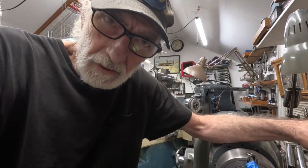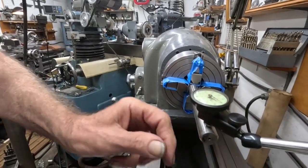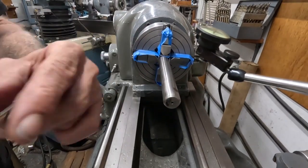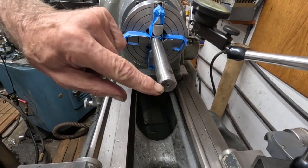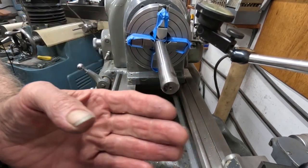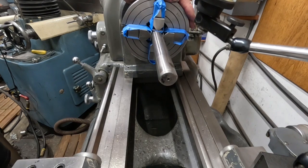When you're working with lengths, there's one really important thing: if this shaft here has a center right there, and that center does not line up with your tailstock, under no circumstances force the part over with the tail center. Make it run true, because if you're pulling it over with the tail center, your part's going to be machined with stress in it, and it may not be a very good part.